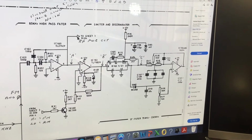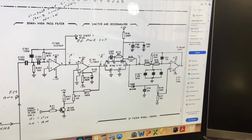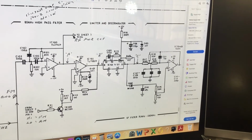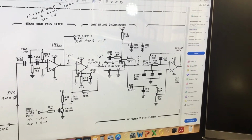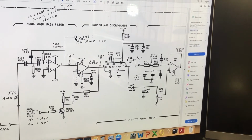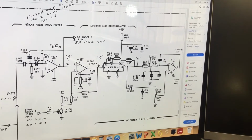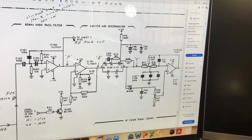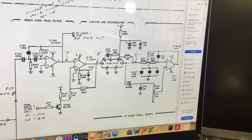And I've actually removed this capacitor and measured it. Well, in circuit I measured it across the Zener diode and it's a dead short. It's not even resistive, like 0.1 ohm. And it's the same value and component that was in the other video, which you'll see. But if you just bear with me a moment, I will switch off the test set, remove the board, and then I will show you the component itself and the measurement. So I'll just remove the board, I'll switch the test set off.